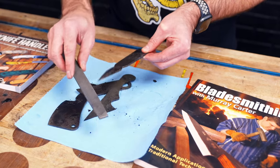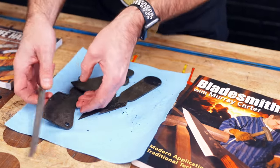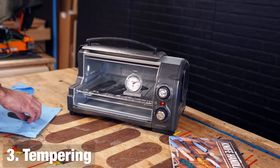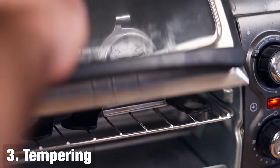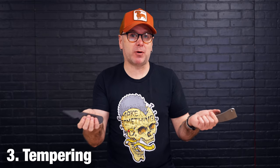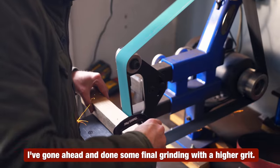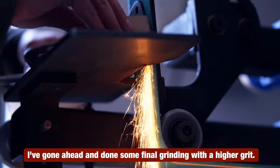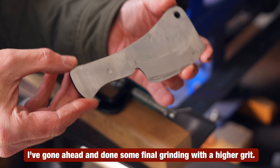And again, we're just making box cutters today. After quenching, you can take a file and rub it over the steel — if the file digs into it, it's still too soft and you did not harden it enough. If it does not dig into the steel, you're good to go to the next process. The final heat cycle is tempering, which removes some of the brittleness and softens the metal slightly. At this point the steel is so brittle you could drop it and it could crack. With tempering you have complete control of how hard or soft you want your blade. This is done at a much lower temperature — around 425 degrees — and can be done in an oven.